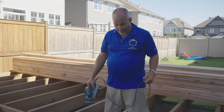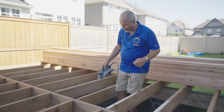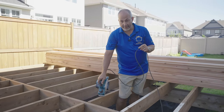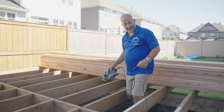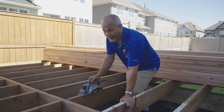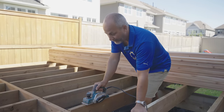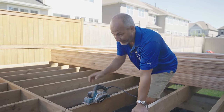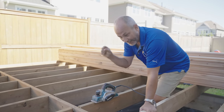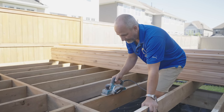Inevitably, somebody's going to be like, oh my God, you're weakening your wood. Yeah, right, okay, I'm taking an eighth of it off. The point is that this is a 2x8, and a 2x8 floor joist can span 12 feet. We're only going 8 feet box to box. So it doesn't take a rocket scientist to figure out that I'm going to have plenty of structural strength. This is one of the reasons why you don't want to go undersize on your wood when you're building, because then you really do put yourself in a situation. Like if I use 2x6, I'd have to have a beam every 5 feet. And then if I started doing this, man, that's going to be dramatic, right? Because it's not about taking an eighth off, it's the percentage total of the thickness of that board. That would be an issue.